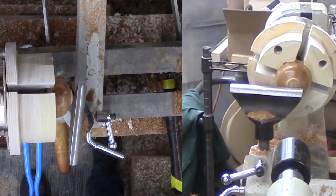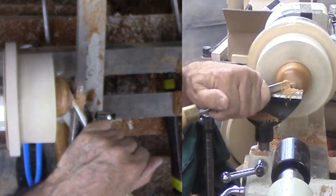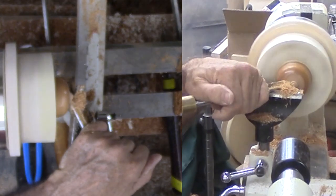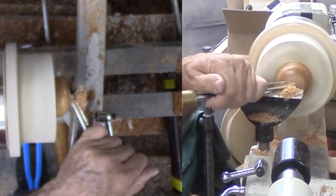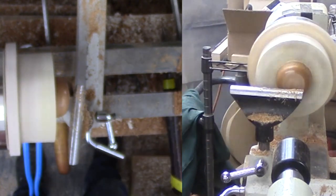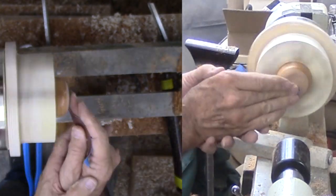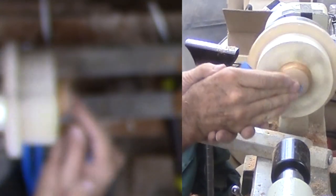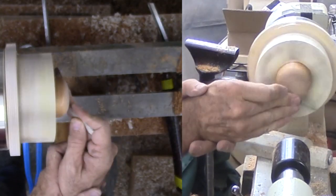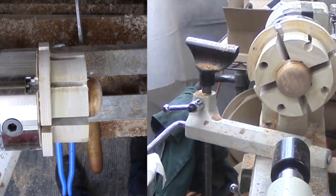You would think I'm finished, but the bottom of the bowl is still nasty. Time for my wood soft jaws. I've tried wood collets and jam chucks, but since I can quickly customize the fit, this is great — much better than a jam chuck and holds tight. Customizing gradually increases the minimum size the jaws can handle. But since it only takes a little wood, I can re-face the jaws and use them again. If all wood is gone, glue on new jaws. I do not need to purchase a new set of plastic jaws.